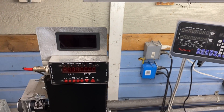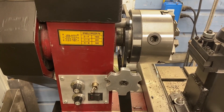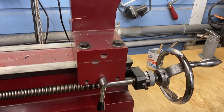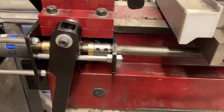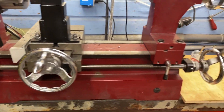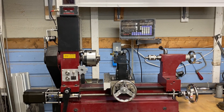You may look at this list — especially the top four: DRO, separating it into two machines, ELS — and wonder why the treadmill motor is number one. Well, that's pretty simple. The treadmill motor upgrade gave me variable speed, and it was variable speed that allowed me to install the ELS. I would not be able to thread at 500 RPMs, which was the minimum speed before this upgrade. And it was the treadmill motor that allowed me to separate this into two individual machines, because the mill is also powered by a treadmill motor. If you like what you've seen, please click like. If you'd like to see more, please subscribe. Thanks for watching. So there's my 3-in-1 mill lathe combo as it looks today.